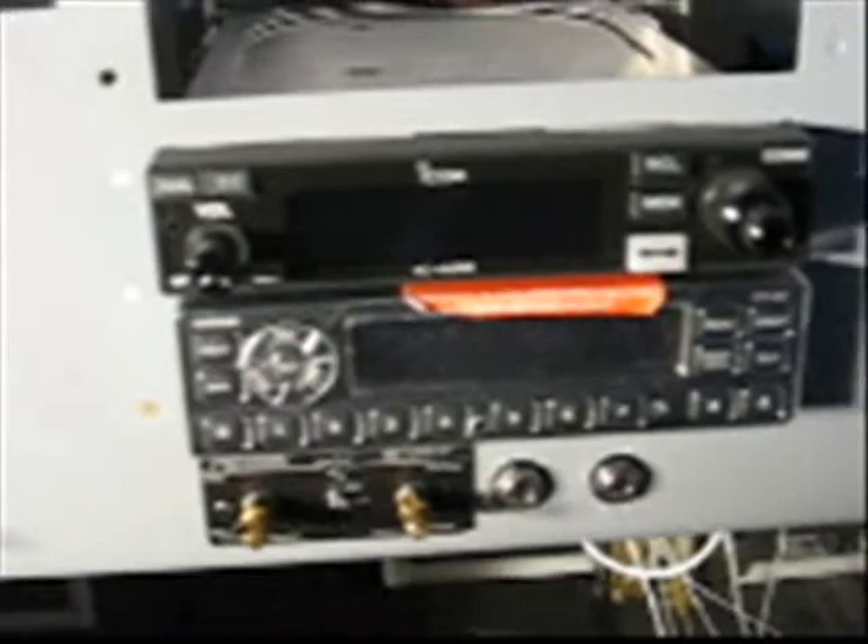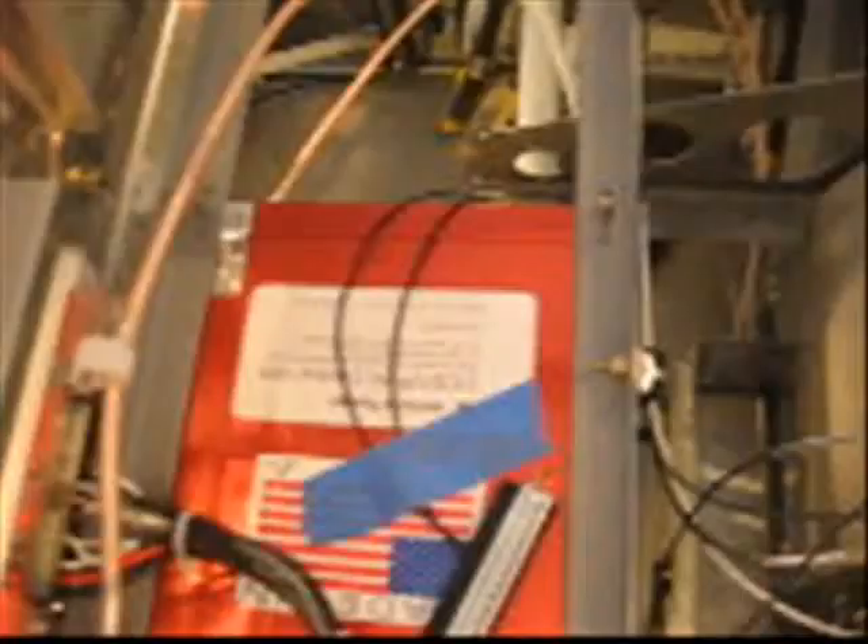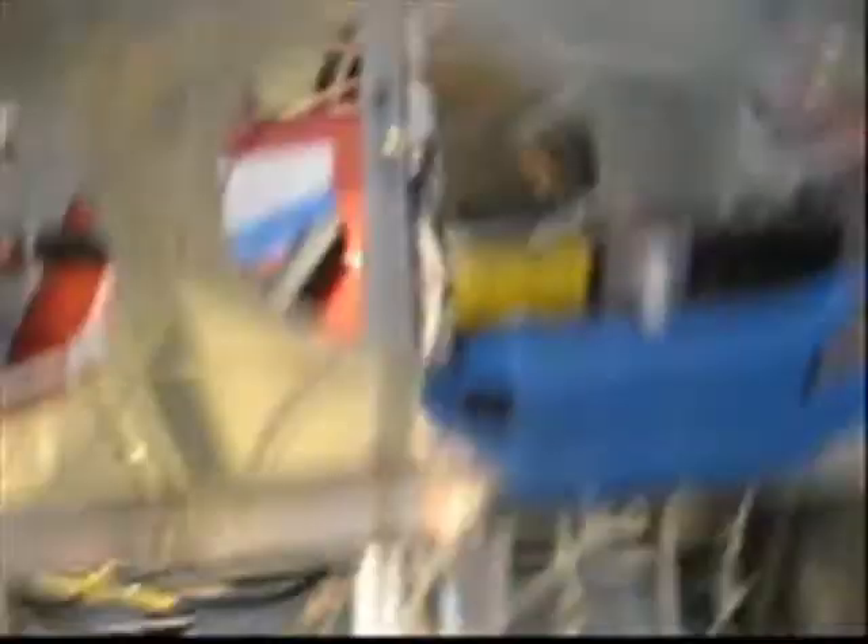A lot of this pre-work comes from the load planning worksheet, because each pin is a little bit different in terms of max amps and current. Once you figure out your electrical system and go through the spreadsheet that Vertical Power describes, you're probably 60% done. I look at my spreadsheet and find out the intercom is going to be on pin 20 on the J8 connector. The J8 connector is on this side of the Vertical Power control unit; the big plug is on this side, and it also has the ground for the unit.